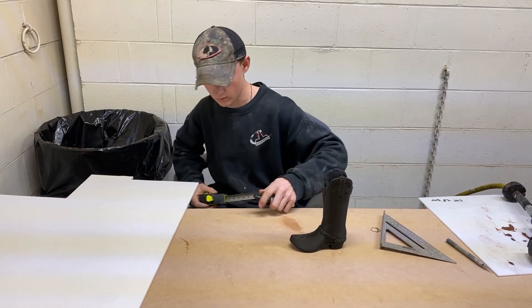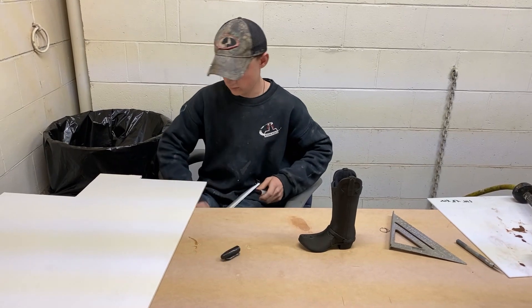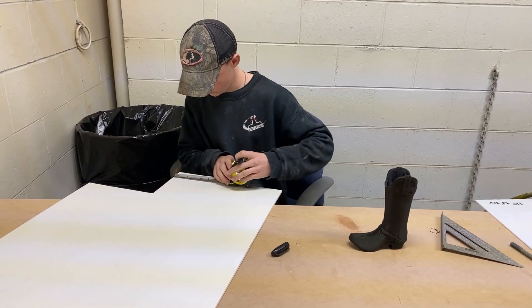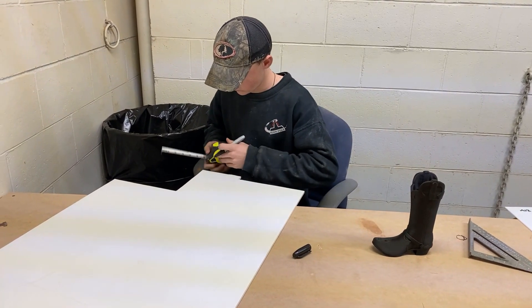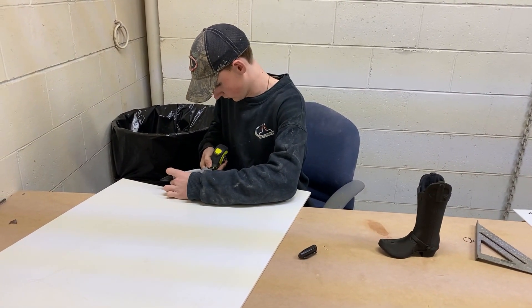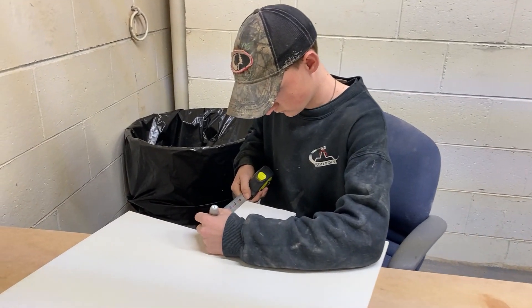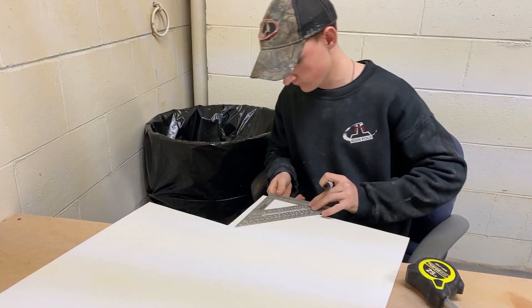You can just make a box and guess and make a huge box, but then you're going to use way more silicone than you need, and nobody likes spending more money than they have to. We like to have about a quarter to a half inch on each side of the piece of silicone in the mold — any more than that is kind of a waste.